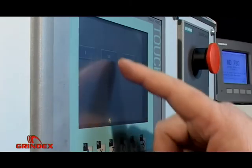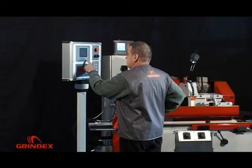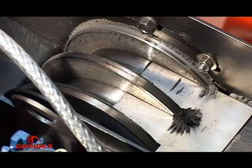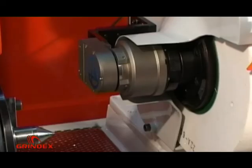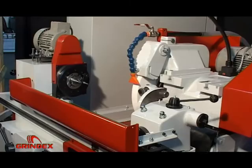The machine is equipped with a Siemens controller SIMATIC S7-1500. Besides the controller, on the machine there are assembled other devices such as a coolant magnetic clarifier, a device for wheel dynamic balancing, and linear encoders for table traverse and wheel head cross slide movement.